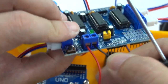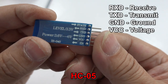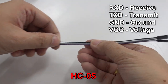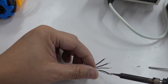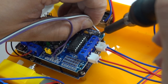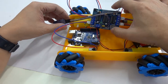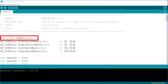To control the car, you need to connect a Bluetooth module. The HC-05 module we use has four pins: RXD, TXD, GND, and VCC. GND and VCC supply power to the Bluetooth module; RXD and TXD are the receiving and transmitting pins. VCC and GND take power from the shield. RX should be connected to Arduino TX, and TX should be connected to Arduino RX, so the Bluetooth module and Arduino can communicate. Note that RX and TX are also used when uploading programs to Arduino via USB, so every time you upload a program, you must unplug the Bluetooth module or shield.